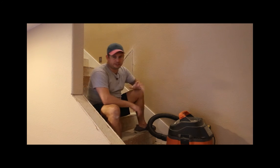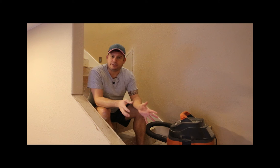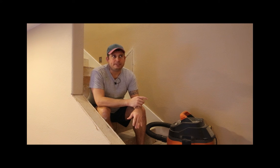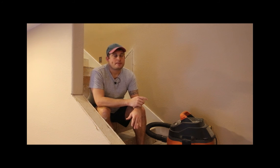So what I'm gonna do at this point is mix up a little batch of mud to do the areas I need to patch, and then I'm gonna come back here and put that mud on. Mud comes in 20, 45 minute, and 90 minute formulations. I've got 90 minute mud here because that's what I used when I did the majority of the house. I've also got 20 minute mud, and 20-minute mud is good for real quick touch-ups.